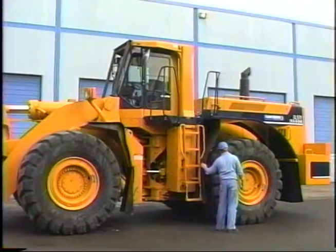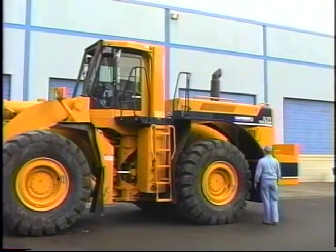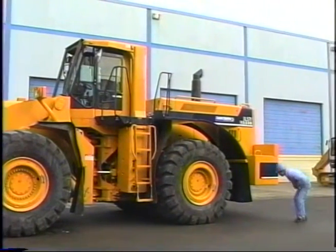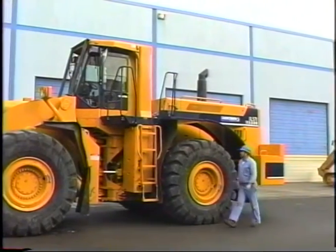The brake oil tank has a sight glass under the left side ladder. Do not operate the machine if no oil shows in the glass. Finally, inspect the left rear tire. Many operators also like to check under the machine looking for hoses or wiring hanging down.